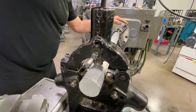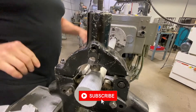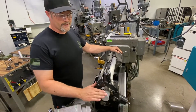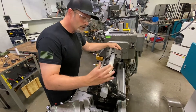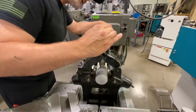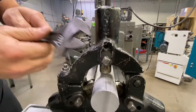We aligned our two bottom rollers. The last thing to do now is to bring our top roller down into contact. I'm just going to bring that down ever so slightly and just put a small amount of hand pressure on it. This kind of varies depending on the diameter of the part and the amount of machining forces that we're applying to the end of this part — this may need to be adjusted accordingly. So now I have that top wheel making contact, and my two bottom wheels are making contact. I can go ahead and tighten up my jam nut.